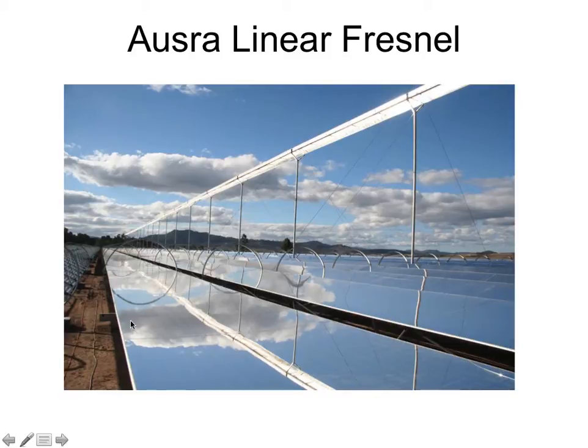Asra had a very novel design where these are slightly parabolic and the sunlight is focused on tubes under another solar reflector. Because they were face-down, there was no convective cooling, and they were able to heat these tubes without the use of double-wall vacuum, which made them cheaper. As the sun moved, these bicycle wheel-like things on a track would turn, keeping the sunlight focused onto the heat receiver. Recently, Asra built a one-megawatt test facility near Bakersfield and promptly sold their business, leading one to believe maybe the technology didn't pan out the way they thought it would.